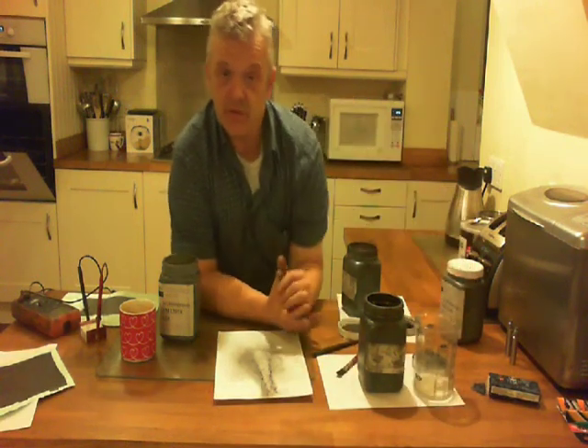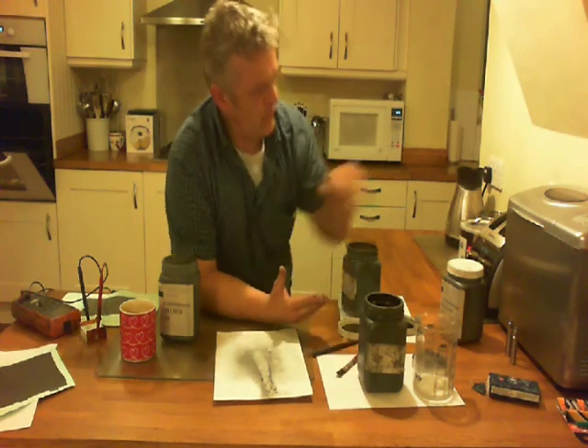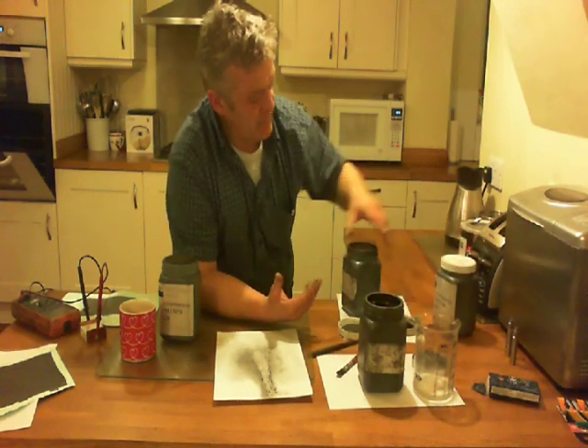I've been using sodium silicate to make a ceramic conductive paint, so you can paint it on the bottom of a plate, pop it on an induction heater, and it will heat the plate. Another version is a water-based one, where you get actually quite good conductivity and flow. And another one is a waterproof version. So I've been making these various inks.